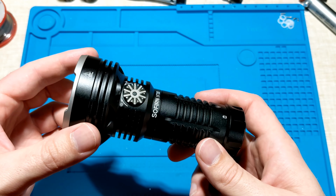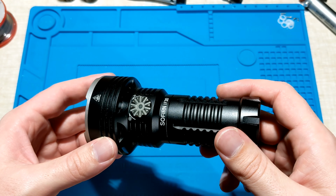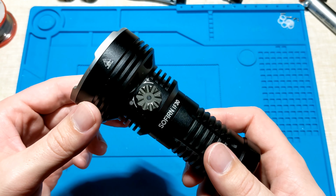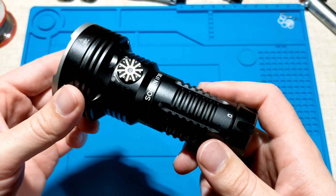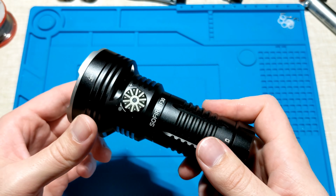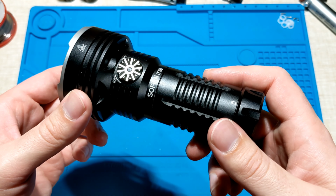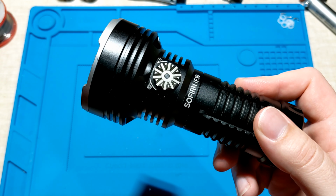It's like 6.5 amp maximum continuous discharge rate, which is a little bit low for the requirements. So this hits about 35 amps on turbo, and it looks like the battery is probably getting damaged over time when I'm using turbo continuously. You can see by the runtime graphs before are getting slightly worse and worse each time with the output not quite hitting that 12,000 lumens each time. It's just getting lower and lower.